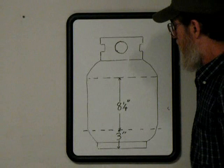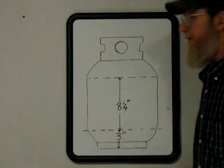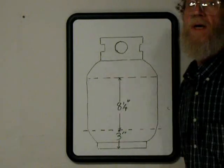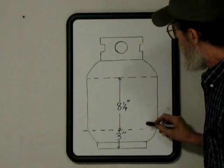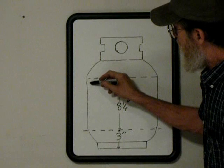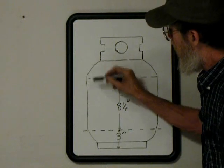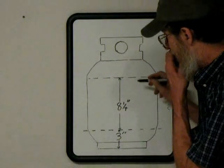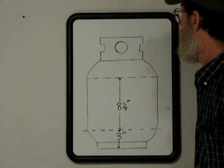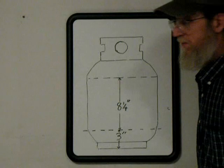In order to make this, we're going to measure from the bottom about three inches and make a mark. Then we're going to measure from that mark eight and a quarter inches and mark it for cutting — this will be the section we will be using. We'll weld two handles onto the side of it, add the ceramic blanket with it being an inch away from both the top and the bottom, then put our tube liner in it and pour the refractory cement. That's really much simpler than what we just built.